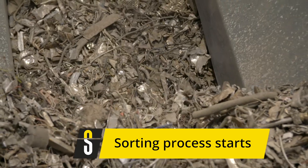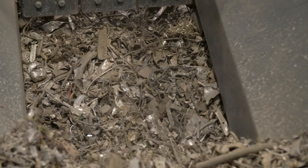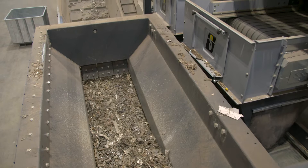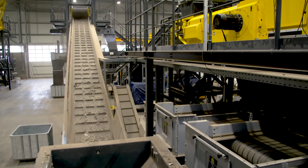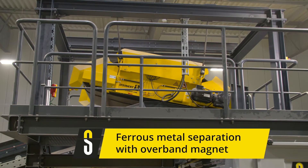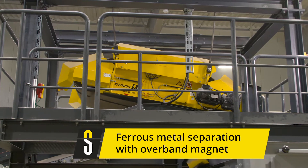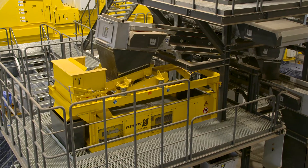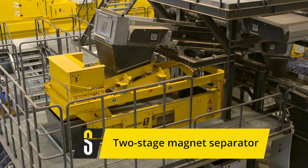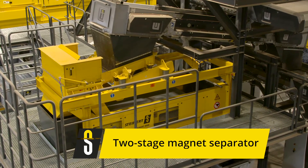The material amount for a test mainly depends on specific material parameters. The processing line is equipped with different magnetic separators. These vary in material removal method — either pickup or overfed — and with regards to the magnetic field strength. This provides a choice depending on the requirement between quality of magnetic product and the extent of the ferrous removal.